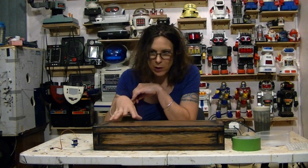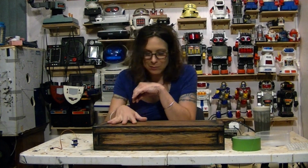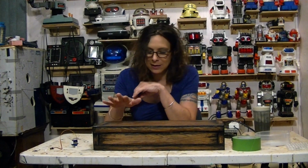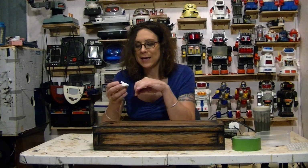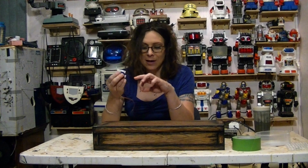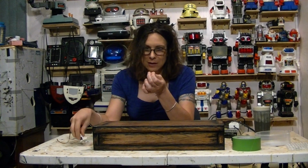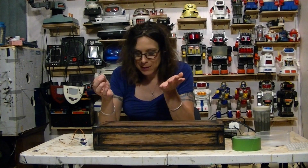So these are like 12 volts are the ones I've got. So I don't really want to be switching to 12 volts. I think it can be done easier. And what easier way is just to use a servo and put a magnet on there. So a magnet just moves in front and away from it. I think that will be easier.